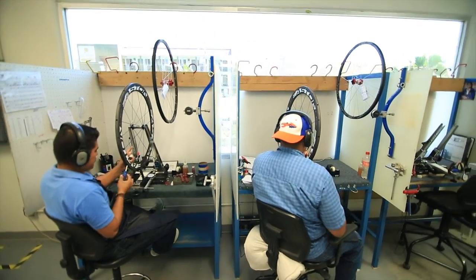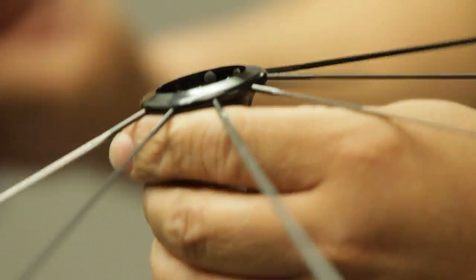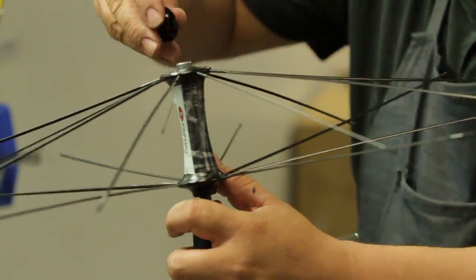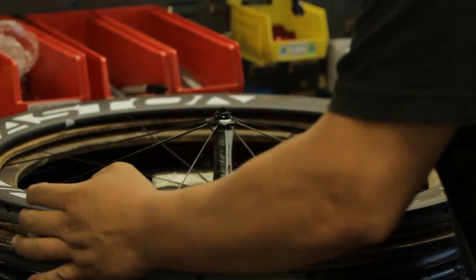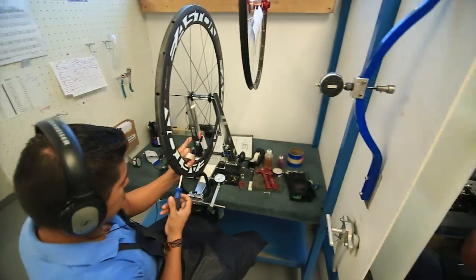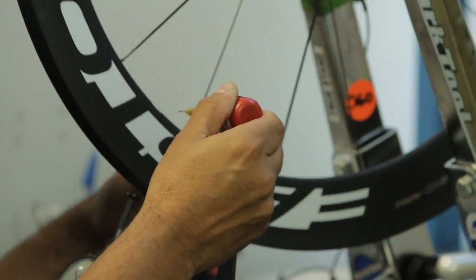In the assembly room, they take that rim and build it into a complete wheel. Step one is to take the hub and insert the spokes: the hub needs to be disassembled, spokes are inserted, and the hub gets reassembled. At this time, they can check that the bearing function works well and the spokes all insert through the hub cleanly. The hub and spokes are then attached to the rim, and the technician threads the nipple on about halfway. This doesn't yield a built wheel, but it preps it to be trued by the technician.